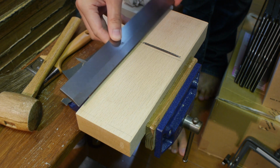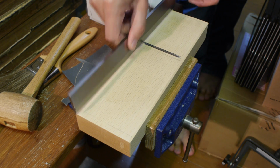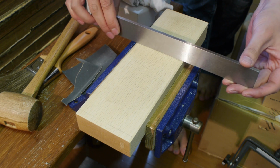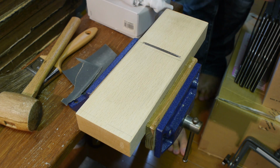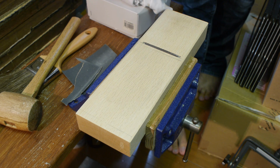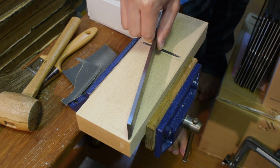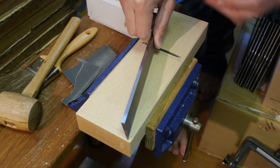Now, the other thing you'll need is a straight edge. This is a 30cm long one, and it is used to check the concavity and also the flatness. The first thing you want to do is check across all these points to make sure they are all flat from your sandpaper. If they're not, correct them either with scraping or more sandpapering, and get them flat first. Next, go diagonal and see what the state of your sole is. From the sandpaper, you may not have a perfectly flat surface, so get a straight edge and check under here against the light and see if you have any irregularities.